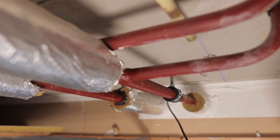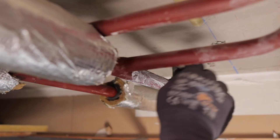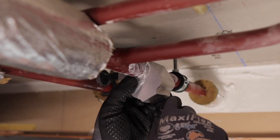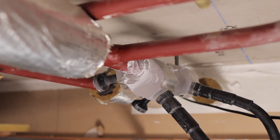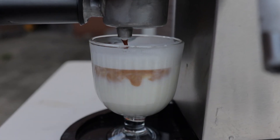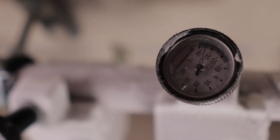We're going to freeze the second pipe with this neat device. It's actually pretty simple — you apply a conducting gel to the exterior clamps and clamp them onto the heating pipes. After that it's a waiting game. Once my pipe reaches below -22 degrees, I know the ice plug has formed and I can calmly cut the pipe. But before I do, I'm going to run a check. It seems to be at the right temperature: -20 degrees on one side and -30 degrees on the other, so I'm confident we've got an ice plug.